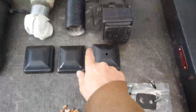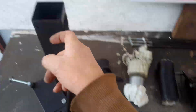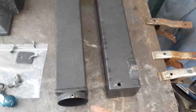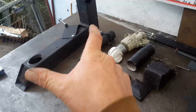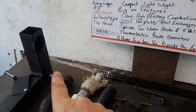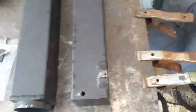Then we have the end caps — I drilled a hole in that one to see the flame, and you can see the flame come up around the corner. It's like an upside-down wooden Roman candle. Here we have the heat exchanger that bolts to that. After we get our clean and complete combustion in this superheated induction rocket stove, we remove the hot gases — at this point about 600 degrees — and they exit through here, passing through this heat exchanger on their way to exhausting out the chimney you provide.